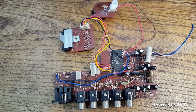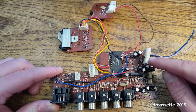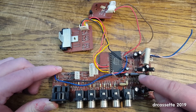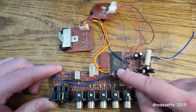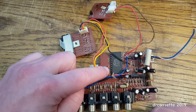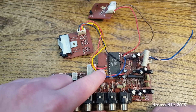Here are all the boards associated with the inputs. We have the inputs themselves right there, obviously. Power comes in right there — apparently the voltage is too high, so there is a dropping resistor. This is the phono input, and the dual operational amplifier for the phono pre-amplifier is right next to that. This is an analog multiplexing IC — this is basically the input selector switch, except it is digitally controlled. And it turns out I was right: this auto function board connects straight to this multiplexing IC, so the devices connected to it had the ability to either send out an impulse or a constant voltage that would change the input on the amplifier.